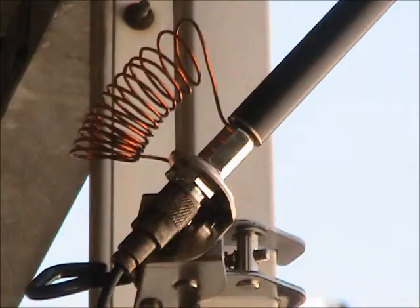I do not use the shunt coil on higher frequencies like 10 MHz, 14, 18 MHz, etc. Due to the antenna's low impedance on 7 MHz and below, a shunt matching coil can be used to lower the SWR to under 2 to 1 on those frequencies. The shunt coil is not needed on 10 MHz and above.